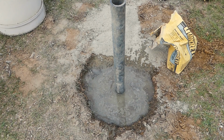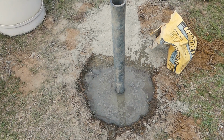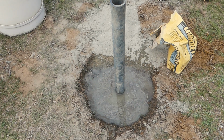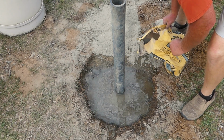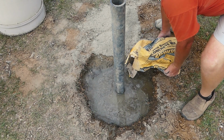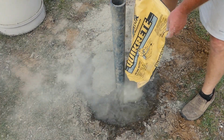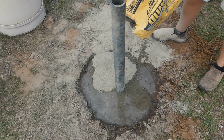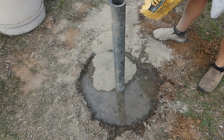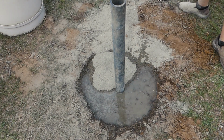So every now and then I run into somebody who takes exception to the way that I pour concrete. Well, I don't care for it. Every bit of 40 years, and none of my pipes have fallen down. None of my fence has fallen down. This is ready mix. It's already mixed up in all the way that I use it. If you pour it fast enough, the gravel won't settle out from the mud. I'm not trickling it in there. I'm dumping it in there, getting it super saturated all at once.